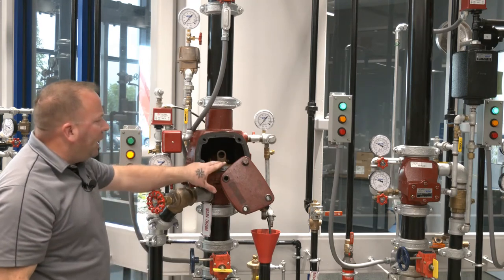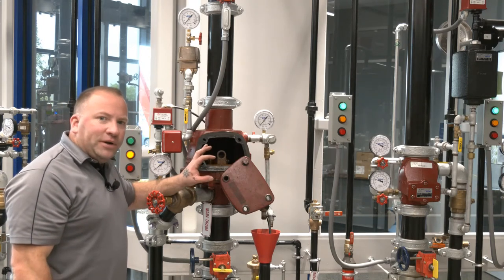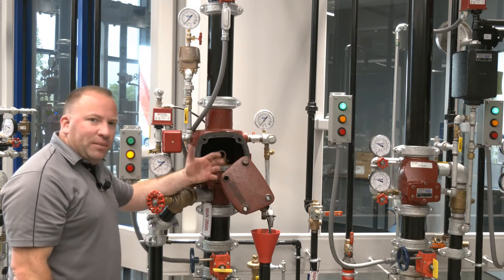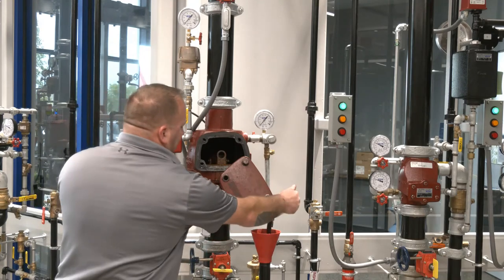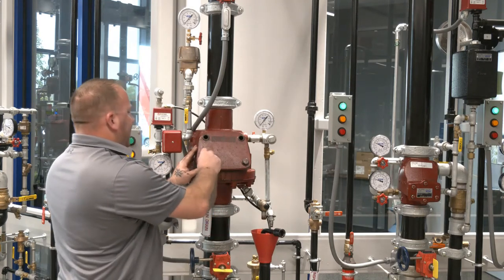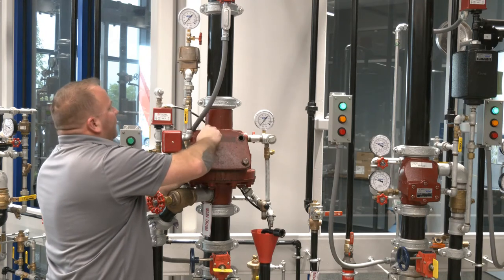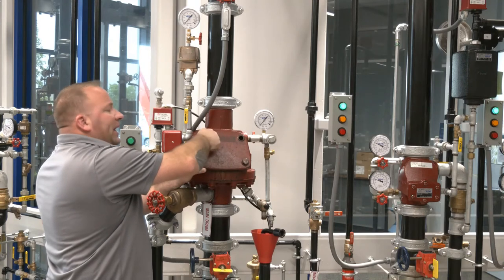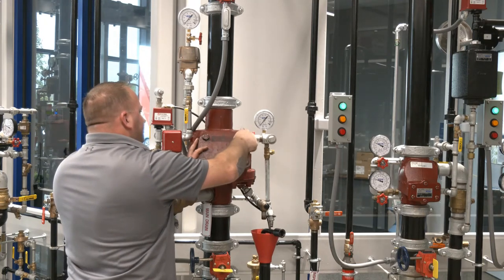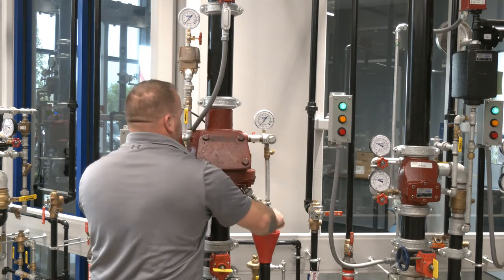With that in the latched position, the clapper has been reset. The clapper is spring-loaded, so we want to definitely limit putting our fingers or hands inside the valve — it opens with a little bit of force, so keep fingers out of the valve. With the clapper reset, we're going to go ahead and put the handhold cover back on, thread the bolts back in, and then we'll get our air pressure back on. As far as the accelerator is concerned, as long as we had that air pressure drained out, we're okay to re-establish the air pressure and nothing else needs to be done to the accelerator. We're going to make sure all the bolts are tight.